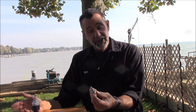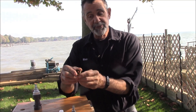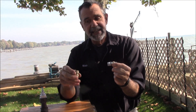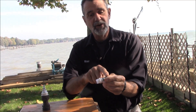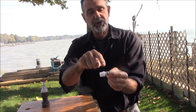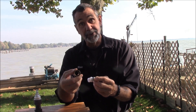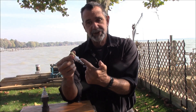Whenever you blow out a sprinkler line or a water line, you need several things. You need an adapter that goes from your air compressor to a pipe thread. Then you need to go from that pipe thread to either a garden hose thread, so I can thread on to a hose bib on the house. This consists of an adapter — you've got to get an adapter to a pipe thread, which requires a bushing. This is air hose to 3/8 pipe, a bushing from 3/8 pipe to half-inch pipe, and a bushing from half-inch pipe to garden hose. Teflon tape — put these three together, screw it onto the house or to a hose bib on a sprinkling system, put the air in, and you can blow it out.